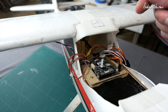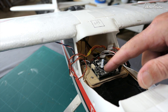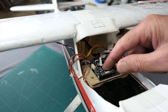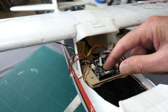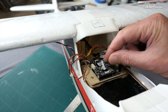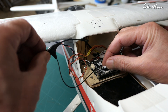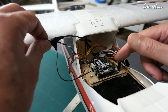I basically had enough signal to take off, then the board went straight into fail-safe mode. I went up to 50 metres and was circling in an oval pattern out over the busy road behind me — very scary. I had no control, zero RSSI, in fail-safe return-to-home mode. I realized I was only on 10 milliwatts, so I boosted the module up to 100 milliwatts on the fly and got just enough signal — even without an antenna connection — to regain control, then landed it straight away and came home. So yeah, I decided I don't really like an onboard receiver mount like that — might make sense on a quad, but it was quite an adventure.